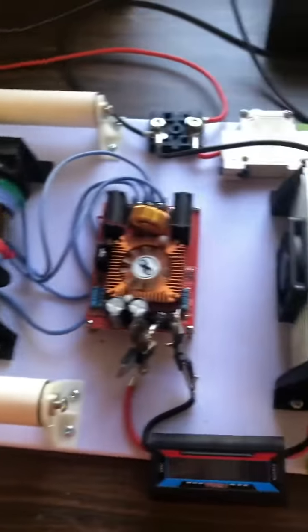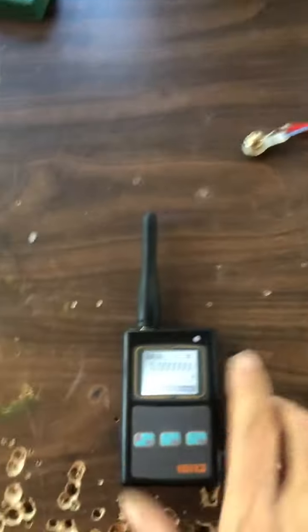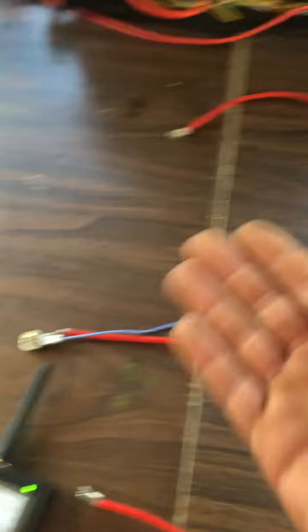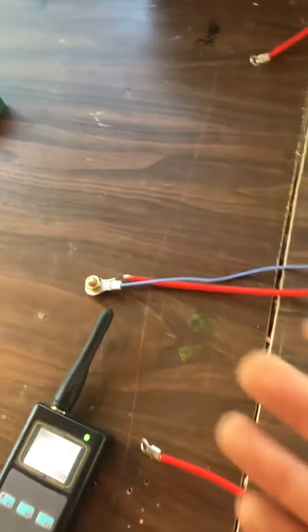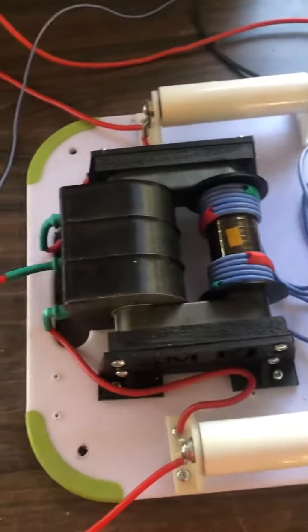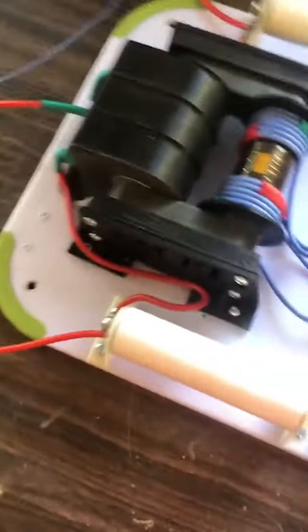Okay guys, it's time to take a bit of a deeper dive into the Smith to hone in on this tuning business. I haven't run this yet — I have in the past but can't remember what it is. We're going to go open circuit with just the earth ground in the proper location, no load, to find the resonant frequency of this circuit. And from that point, we'll take our next steps.